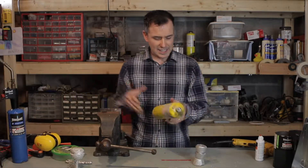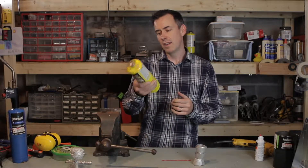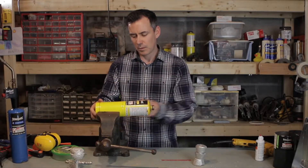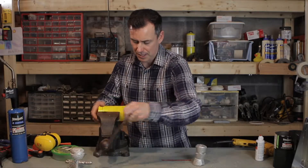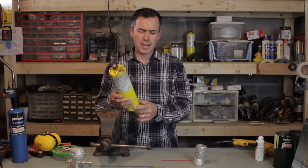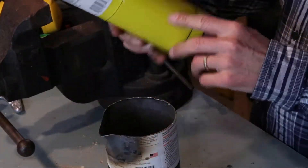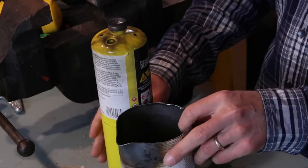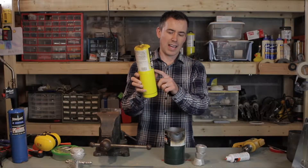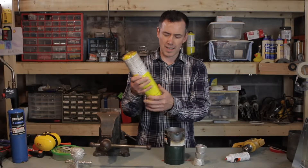There's quite a bit of gas still left in there that just kind of ignites. I'd rather have that ignite now than when I'm cutting it, which is the next step. I put it in the vise and try to first determine what height you want your crucible. I'm going to make one that's basically around the same height as my other one — actually going to go a little bit shorter. I'm just going to go along the line that's already built into this where it has a seam, and just cut along that.